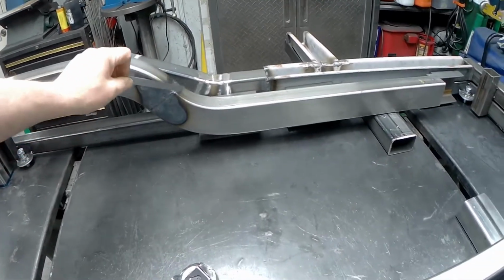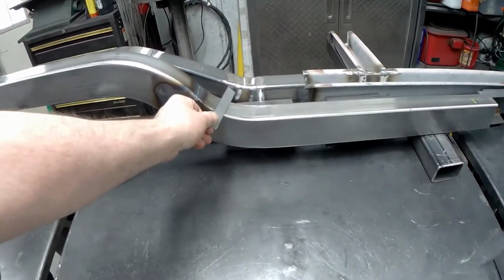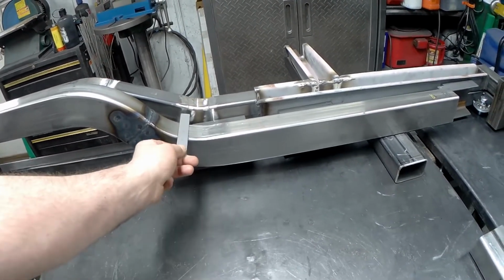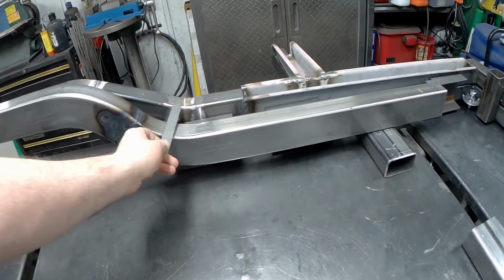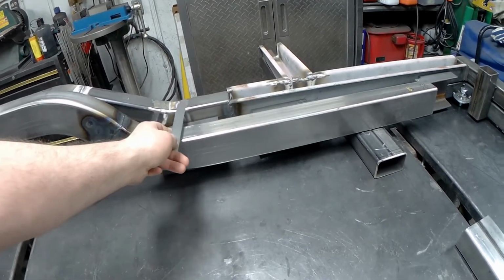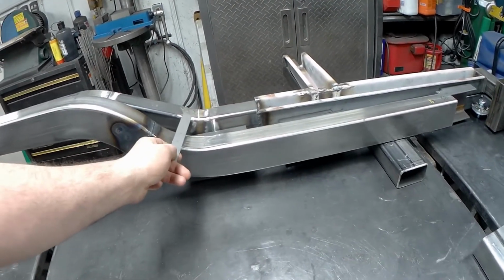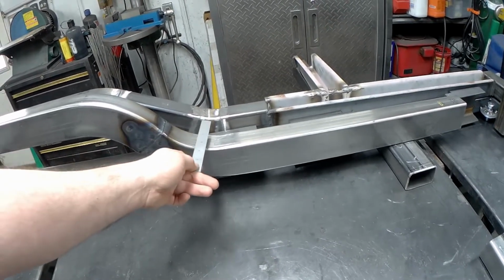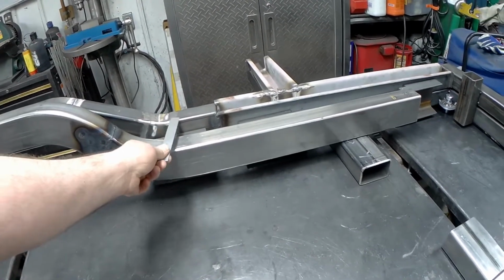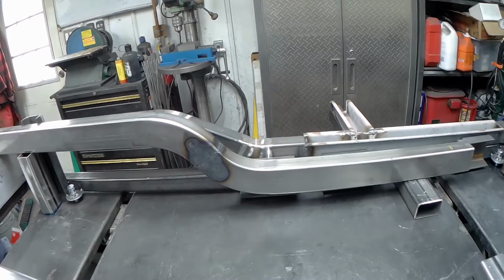So the two rails are aligned at the front edge. But you can see here the difference between the two rails. And my footwell, where I'm putting my pedals, was just barely, you can see I've got a mark I put on that rail, but that's about where the other rail was going to foul this particular piece. So it was going to come in and sit very close to this, and then go off. Now, I didn't really think that was going to be a problem initially, and I don't think it would have represented one, but the way this bend radius goes, I'm going to easily clear that particular tight spot that is on the driver's side of the car. There's no tight spot on the passenger side, so that'll be just fine.